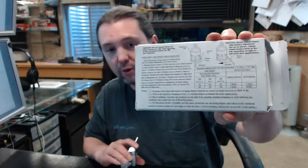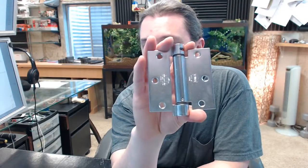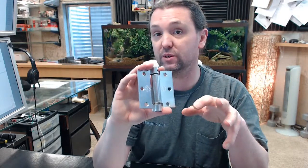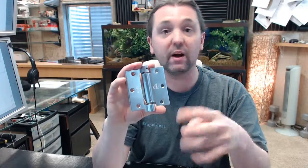There is a link below this video to the installation instructions, and should your order come in a box, and they generally do, but not always, they're printed on the back of the box. Basically what it says is how many hinges you need given the door size and weight that you're going to be encountering. So with a hinge like this, you're really looking at a door not larger than 3 foot by 7 foot. You're looking at a door that's typically not greater than 110 pounds, and in that event you'd certainly want all 3 hinges, or 85 pounds for 2 hinges.